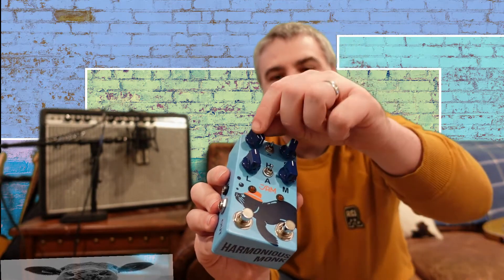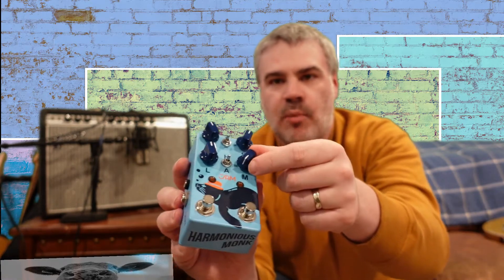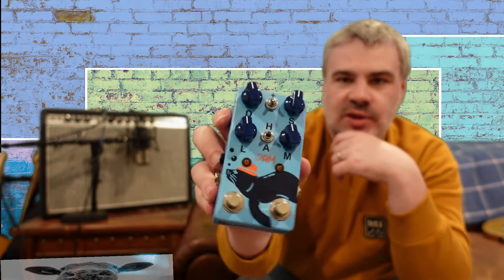Being a boutique pedal means you have four knobs and a switch. L is the overall level of the pedal. S is speed of the tremolo. D is depth — all the way up will basically shut your sound off, bringing signal down to zero when it modulates. M is mix, a wet/dry blend — you can get more dry signal or more tremolo signal. This toggle switch for plus and minus sets more or less intense tremolo — I think it boosts how the depth knob works. The footswitch turns the pedal on, and the second footswitch doubles the speed of the tremolo, which could be interesting.